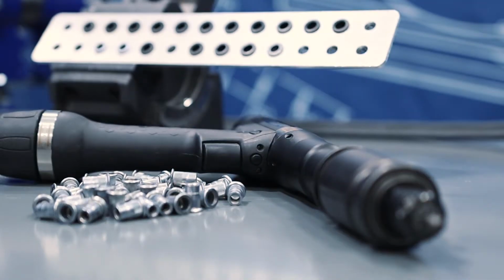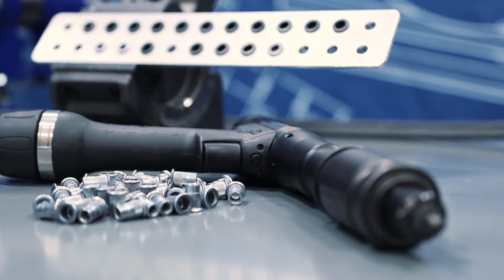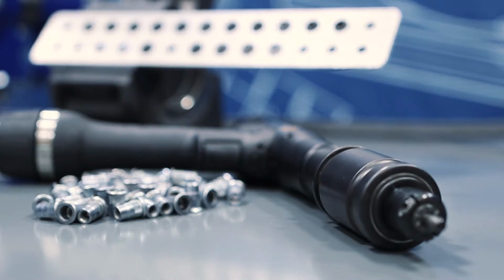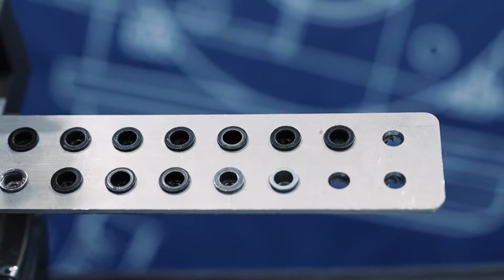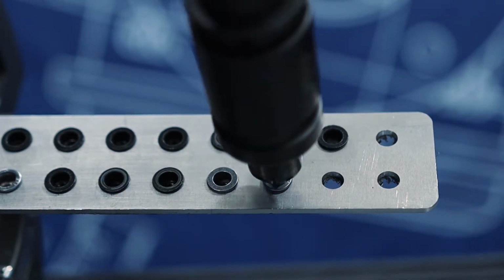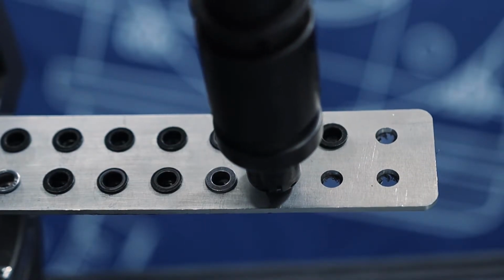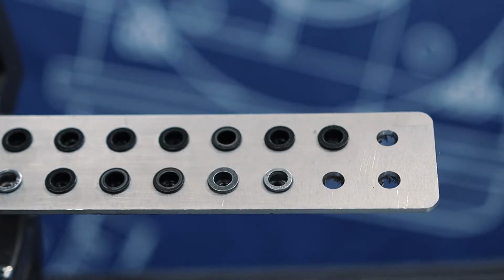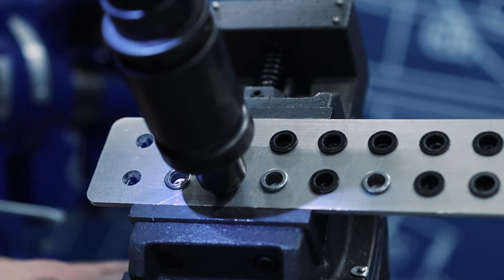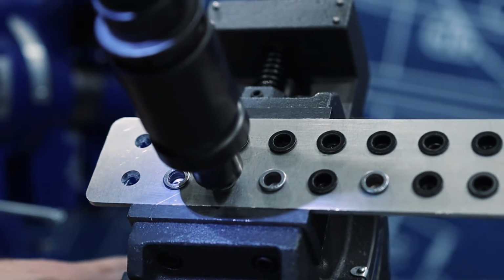With the Atlas Copco threaded insert tool, we're able to accurately install and secure both riv nuts and riv studs from 4 to 8 millimeters, using the spin-to-spin method controlled by AC torque and angle parameters. This technology can be applied again to both straight or pistol tools, whether battery or cable powered. While most applications are handheld, this can also be applied to automation solutions.